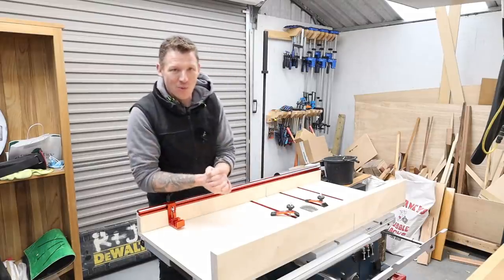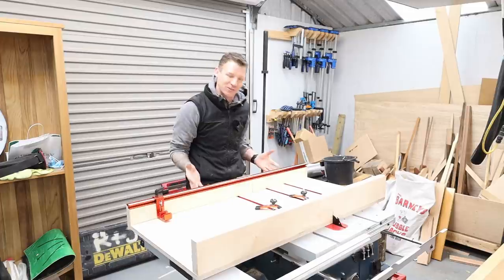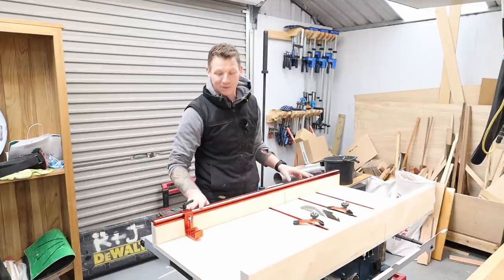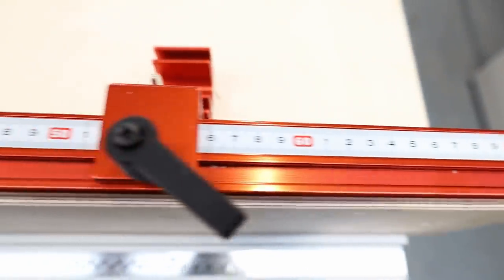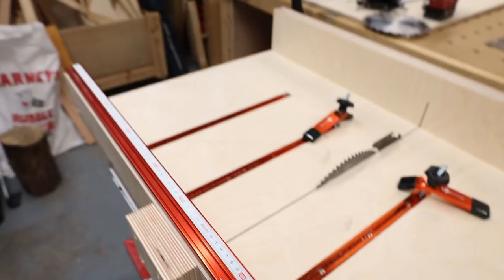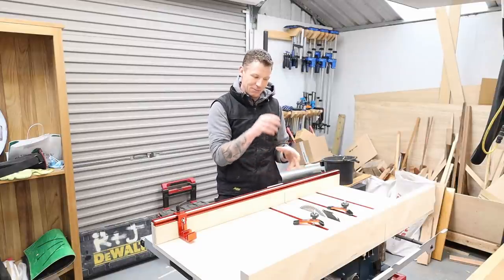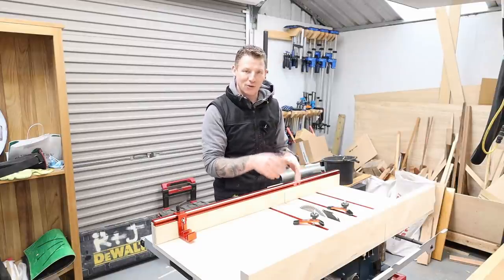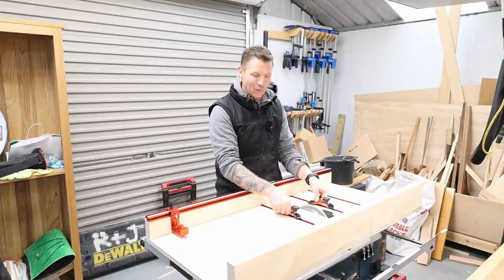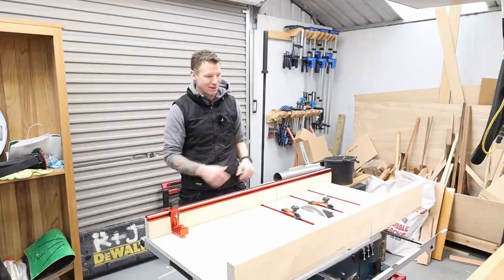Welcome back to the workshop. In this video I'm going to make a nice large capacity cross-cut sled for my new table saw. It has all the bells and whistles: a rail up on top of the front fence, measuring tape left and right of the blade, a repeat stop that can slide up and down, T-tracks, and hold-down clamps. Those clamps are particularly important because the blade runs without its guard in a cross-cut sled — you never want your hands down near the blade. Let the hold-down clamps do that work and save your fingers. Safety first.